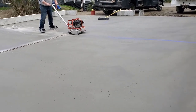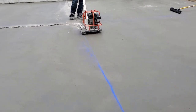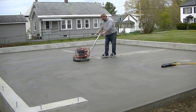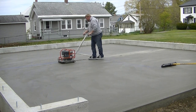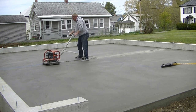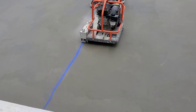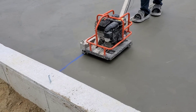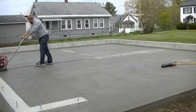If you're pouring a six-inch floor, technically you're supposed to go a quarter of the depth. But if you saw this early in the process, we've never had a problem with six-inch floors cracking in the saw joint. So for us, we use it on all our four-inch and six-inch thick stuff. The good thing about the saw is it's light enough so one guy can pick it up if he needs to. If you've got to put it down in the basement or lift it up into the truck, one guy can do it really easily — anything bigger and you're going to need two guys. Husqvarna makes all kinds of sizes, but this one is probably the most convenient for everybody, whether you're doing residential or light commercial work.